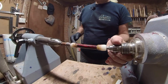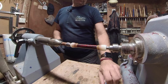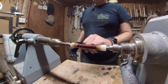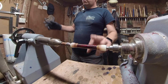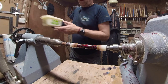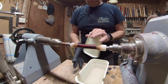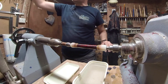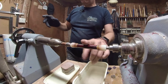Blank is dry. No big ridges in it either, but when you're spraying a car or spraying a lacquer finish you get something called an orange peel finish and I can see it and feel it in there. So we are going to flatten it basically. It's just water — I'm going to start with a 600 grit mesh.